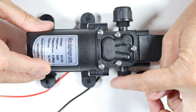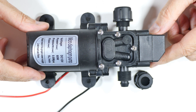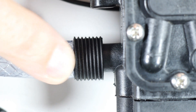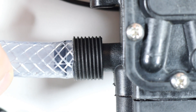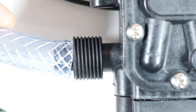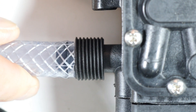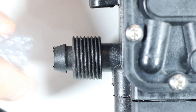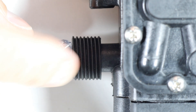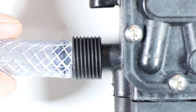The biggest problem is the connector right here — let me zoom in. The first issue is the type of tube you would need for 116 PSI or 0.8 megapascals is something like this, and there's just nothing securing the tube on there. This spear would have to be twice as long to get a good connection.